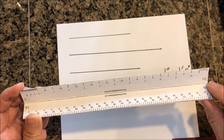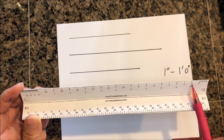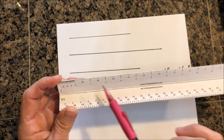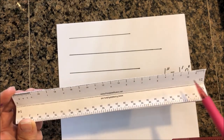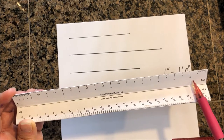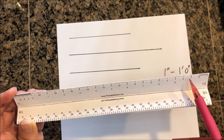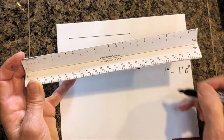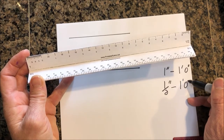We can also look at this half-inch scale. If we take our zero and move to the left — it seems a little odd — that ten belongs with this side. Reading left to right we go one through ten; reading right to left for the half-inch scale it counts by twos: two, four, six, eight. The longer hash marks for the one-inch scale correspond with the odd numbers of the half-inch scale. So on the half-inch scale, half an inch on your architectural ruler equals one foot zero inches.